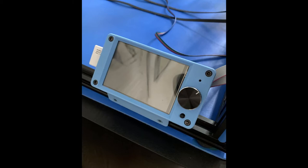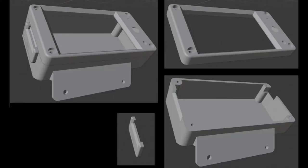Now to go through all the various parts and components with a short summary of each. To start off with, we have the TFT35 screen holder. This design has the knob on the right — there's a similar design that has the knob underneath, so make sure you have the right screen. The design is three basic parts: the main frame that the card fits into, and then the cover to clamp it all in place with four M3 bolts. There's also a USB alignment piece that's supposed to glue onto the side of the card to make the USB slide in easier, but I found that wasn't really needed.